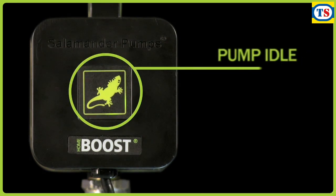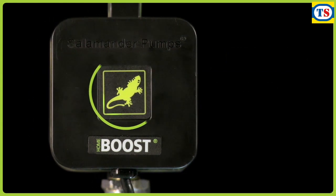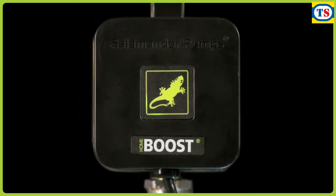When the water demand is present but the flow is maintained at 12 litres per minute, the pump automatically switches to an idle mode, represented with a repeating diagonal flash. If the flow again drops below 12 litres per minute, the pump comes out of its idle mode to assist the water flow, again represented by the light rotating in a clockwise movement.